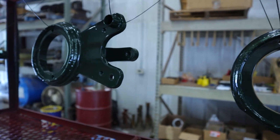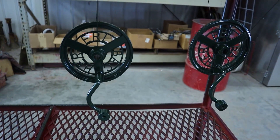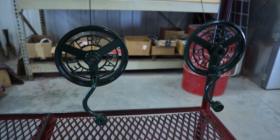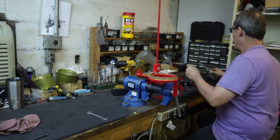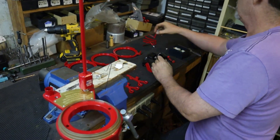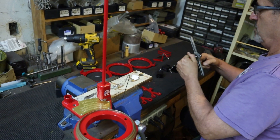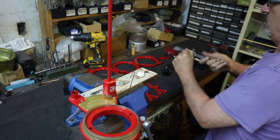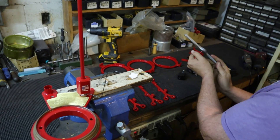Once these bases and handles are cooled, they'll go right back to assembly. Here we have the assembly process. This is Daryl — it looks like he's picked his parts for three machines to build. We usually build between six and nine a week. We have a meeting on Monday to decide what colors, including any custom colors, that Rick needs to have powder coated by Thursday for Daryl to pick parts, and then we build on Friday.